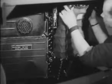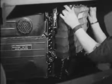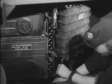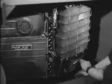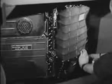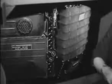These bags are fitted to collect the spent cartridge cases and links, each bag holding returns from two guns. The bags are attached to the turret by a spring plunger at the top and by leather straps and two turn buttons at the bottom.